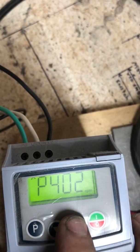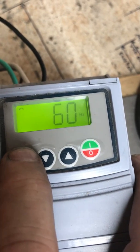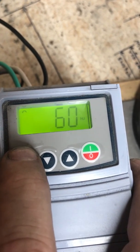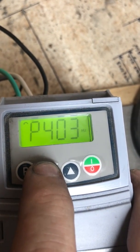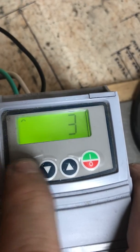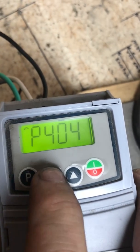Back to our parameter — 403 we're going to go to 502. Double check that it's on — in our case 60 hertz; in the case of the UK you would move that to 50 for 50 hertz. Then we go back to our parameter and go to 404 — we're a half horse motor so 3 is correct. We'll go back to our parameter and go all the way back down to 002 where we started.